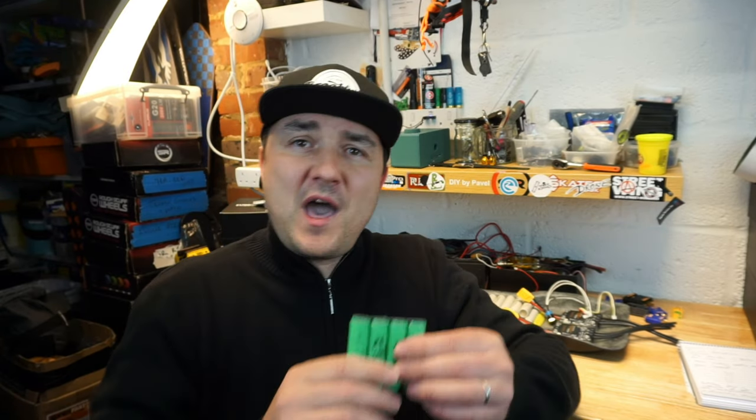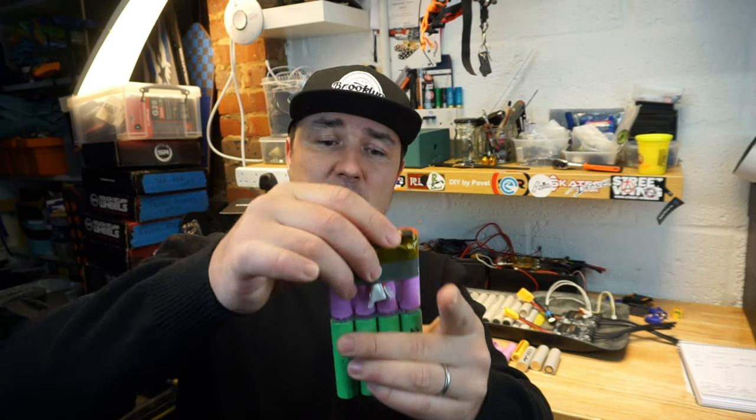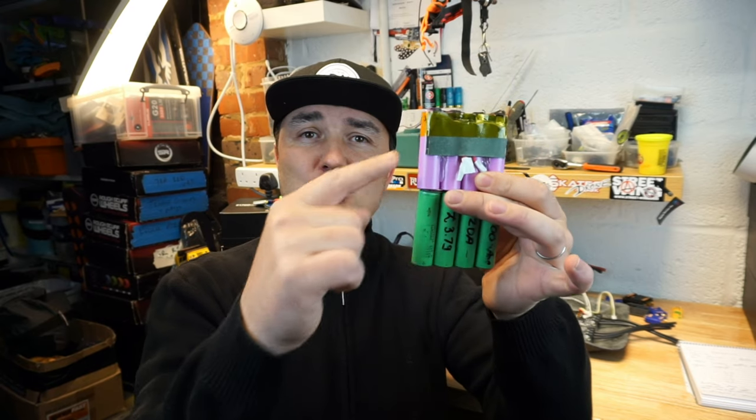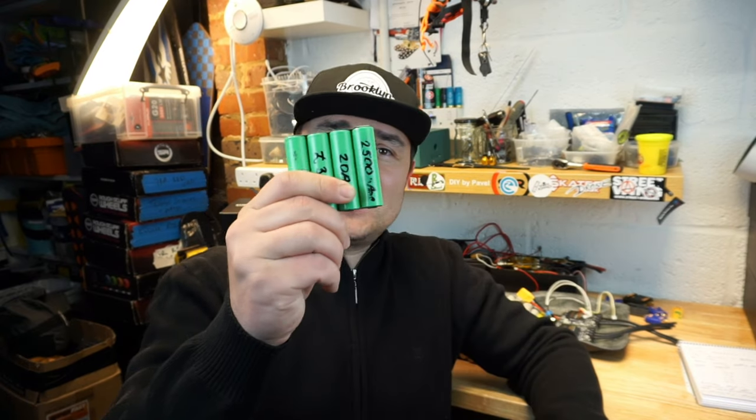Maybe that will help. So what happens in a normal battery pack is you build your P's and then you connect the P packs in series. Let me get it right. Then you connect them in series, so now you are increasing the voltage. So at the moment you're looking at 4P, 2S, so 4 in parallel, 2 in series. In order to get 12S, we need 12 of these connected in series, and that's going to be a 12S 4P pack. I hope this helps guys to understand these weird numbers when you hear 10S 8P.